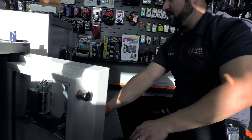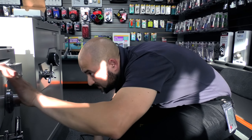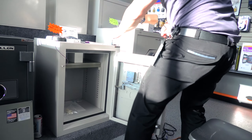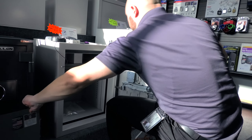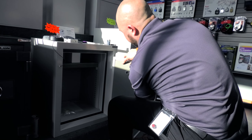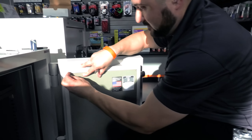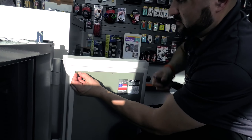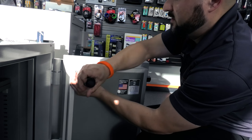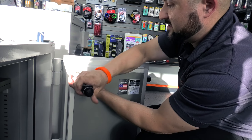This is officially swapped out and works great. We had to do some modification and it came out pretty good. Now I'm putting in the last screws and covering the plate back up. Like anything you do on safes — ever — test the door at least three times with it open. Test it, make sure it works. Change the code with the door open, test it three times, then lock it on the fourth try and test it once more to close it up.